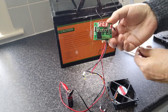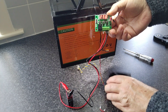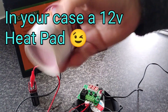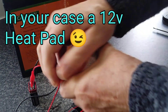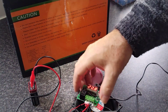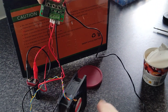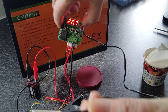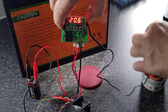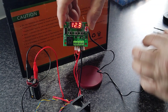If the temperature drops to 12 degrees, the thermostat will supply power to the relay, which will then start your fan — and I'm going to show you that now. I've got a tub of ice cream here with our fan and the thermostat. If I place the probe in the ice cream, we should see the temperature drop down, and when it gets to our set level the fan should kick in — and there you go.